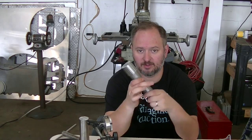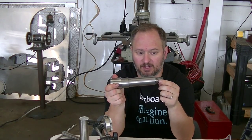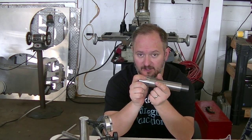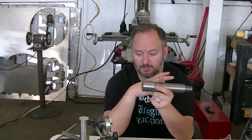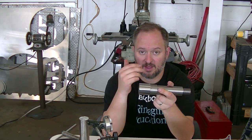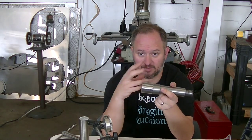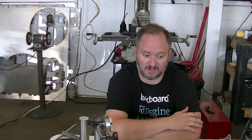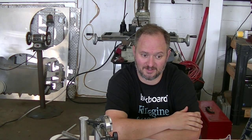I've got it back on the lathe and I can show you that, but I didn't go through the whole thing. I just wanted to show that we've got it all dialed in. The proof for me was that mandrel that we did — I wanted to make sure it was running concentric on the lathe, so I chucked up on the part of the mandrel that is going to be holding the disc, put a new cut on here, and we're now good and concentric. I was getting a cam effect on this previously, so something was out of whack, but we're in great shape now.